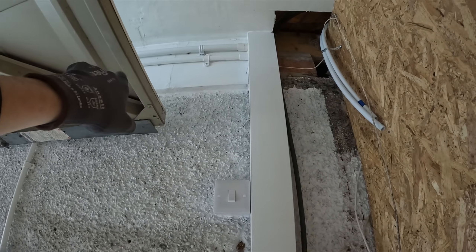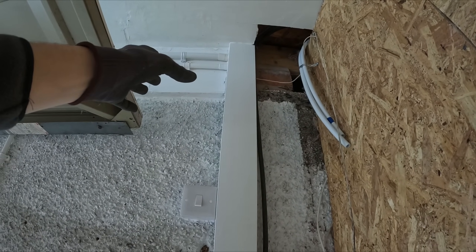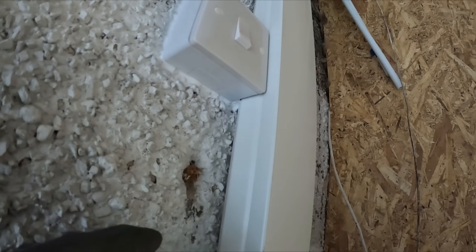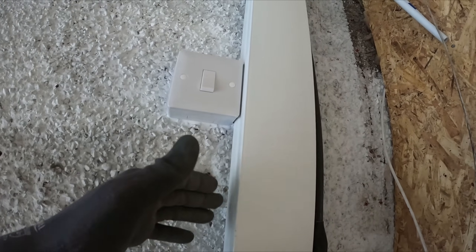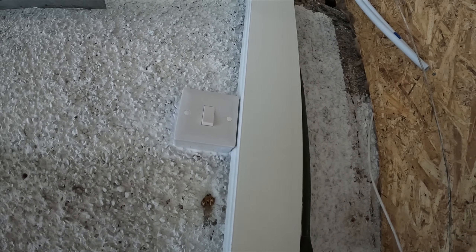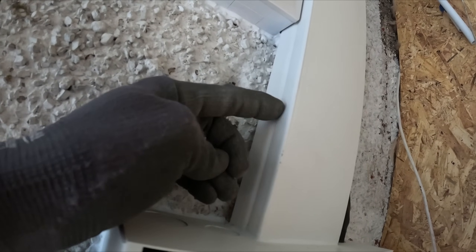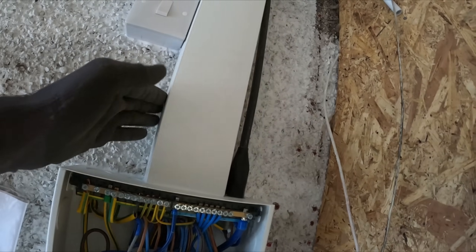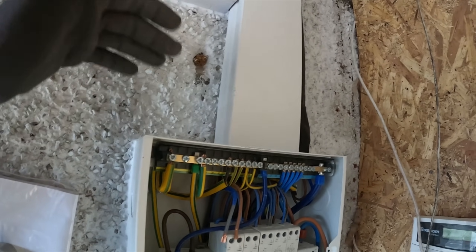The armoured gland is done with a piranha, all tucked up out of the way. It's a nice neat little board - I've gone around with fire sealant caulking stuff around all the edges for that extra little touch, including around all the switches. That switch operates the outside light at the front of the garage which I'm replacing, hence the fitting is just left off but wired back in. I've had a bit of fun with the top 25mm conduit coupler - the trunking has chamfered edges so the conduit entry points don't sit standard; I've had to take a little notch out of the lid and seal it.